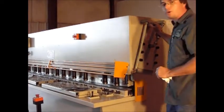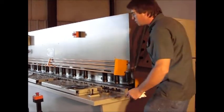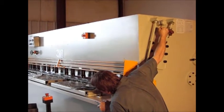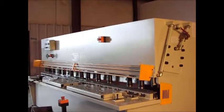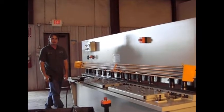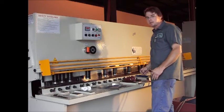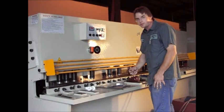What I'm going to do is take the segment that we just pulled out and raise the ram to be in that area so I can check it on that particular one. Take a feeler gauge, come down here, and where the two blades cross - where the upper blade meets - we're going to go ahead and check our blade gap. I'm taking the blade to zero and I've got a 2,000ths feeler gauge.